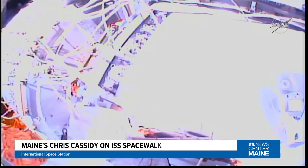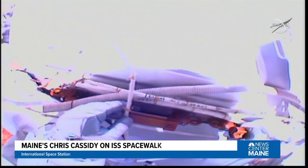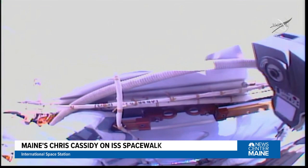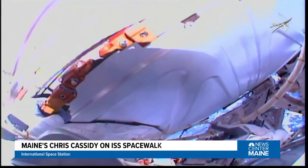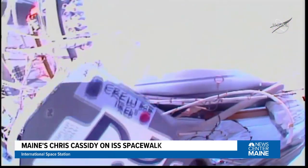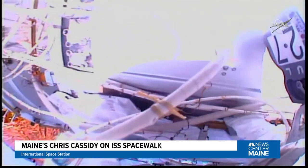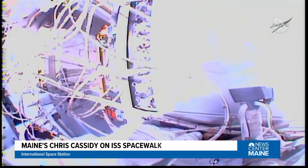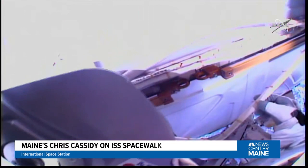I found a coil here at handrail 226, single coil. So if we can confirm that that coil is in cable 4300, then we should be able to undo that, I believe. Yeah, the key, and I understand, is the difficult part is to make sure we're on 4300. Yeah, and I think that cable at this point appears to go into a Y. It's another cable. It is labeled 4300. Got a visual on the label, and then that joins a bundle. A larger cable.